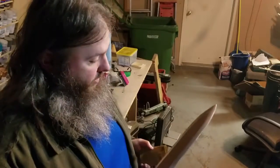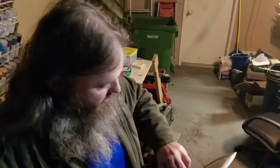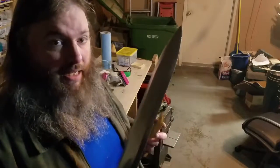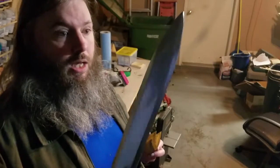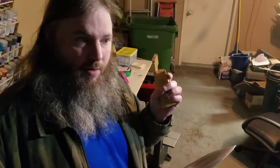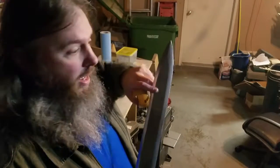Now, sanding these boogers is not as straightforward. I just can't take it to it and just gouge into it, just use a lot of force. You can't do that. When you sand paint, you've got to have a light touch. You want to create powder from the paint. And if you start to generate heat by using too much pressure, that heat will cause it to bind back together and become gummy. And it will stick to your sandpaper, and it will stick to your sword.